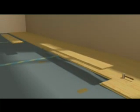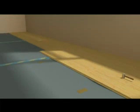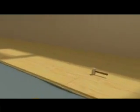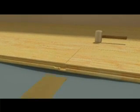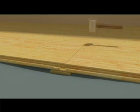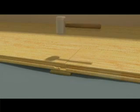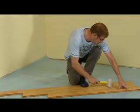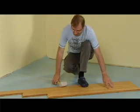6. If two panels are not at the same level, please put a piece of 2 mm plywood under the joint area, or spade the concrete floor to be smooth. While tapping the short edge joint area, we strongly recommend that you use your hand or finger to press the exposed edges of the panels, so that the panels are in full touch with the ground. If the underfloor is extremely uneven, first use a finger to press the low hook of panel 2, then tap the joint area.